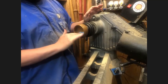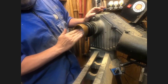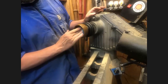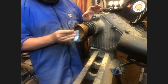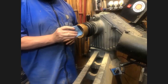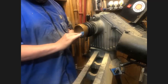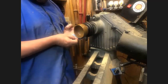Then I'm putting wax on top of wax and not mixing two layers of wax. I don't remember who said it now, Matt or Billy One. If I was going to do lacquer after the abrasive paste, before the wax, I would get it wiped down good. Then I'd come back with a paper towel full of denatured alcohol. I clean that off real good. And then the lacquer would stick to it without any problem.